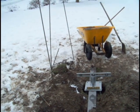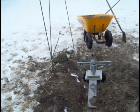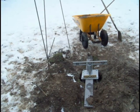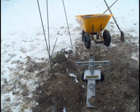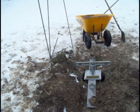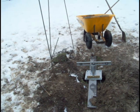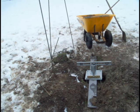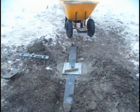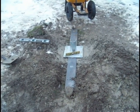Now we've got a lot of concrete in here and we're still not full, so I've got somebody running out for more concrete. In the meantime, the J-bolts are below the surface of the concrete, so I've gone ahead and leveled it off in both directions and it's looking pretty good. We'll add the rest of the concrete, check level one more time, and then cover the hole to trap the heat from the concrete — it's in the high 40s right now and it's going to drop down into the low 20s tonight. Now we've brought it up right to the base and we're going to let it dry.